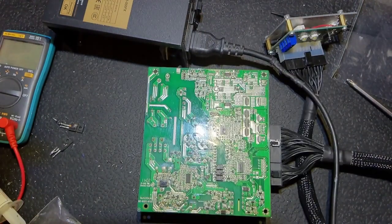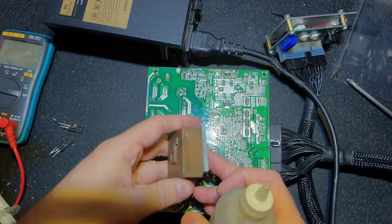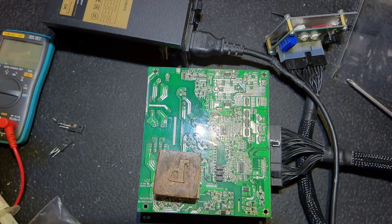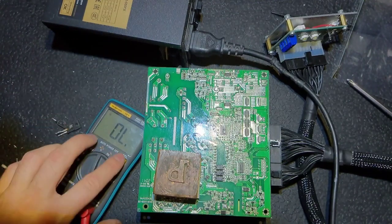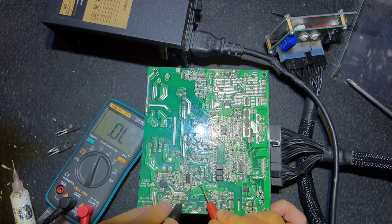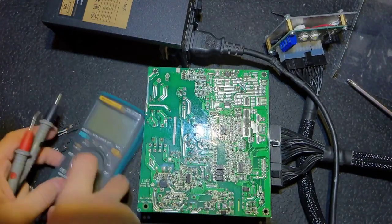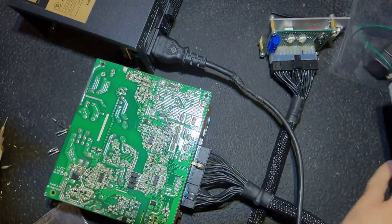The controller is a CM6500. I use this copper chunk for cutting down the IC from the board - I like it, it's pretty heavy and reliable. After cutting down the board and installing the IC, let's measure the controller output again. As you can see, it's now 0.6 volts, which is good. Let's try it one more time.